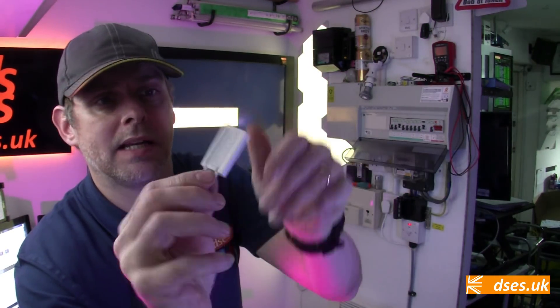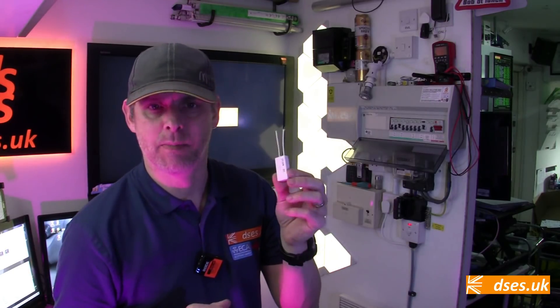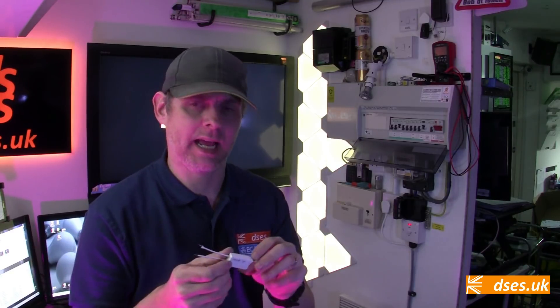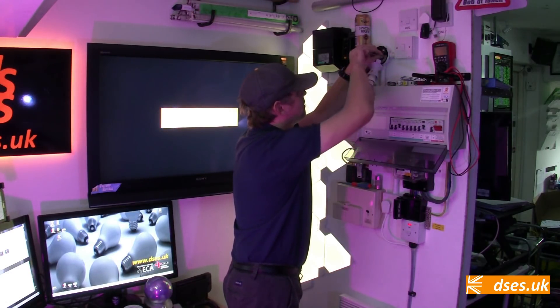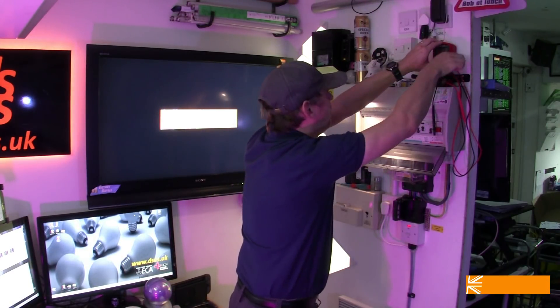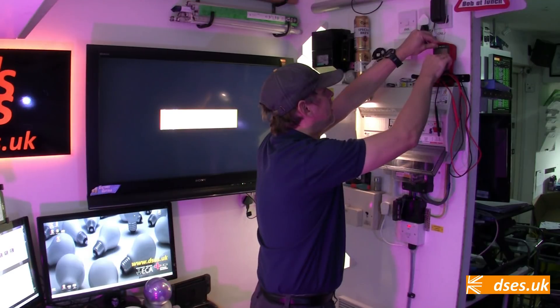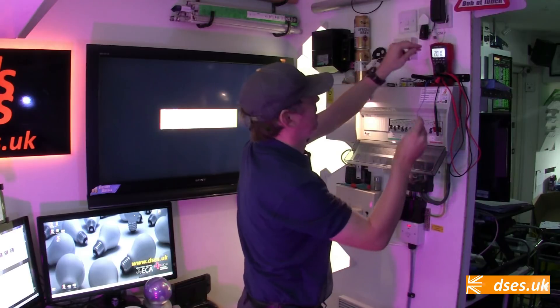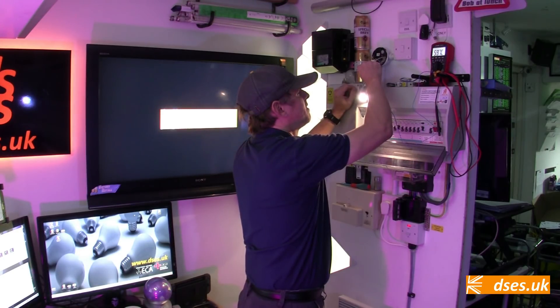I also have some of these — a ceramically cased snubber of some kind provided by a smart switch manufacturer after problems with their products a couple of years back. Simply labelled as 'LED adapter', I don't know what's inside. Resistively it shows about 15k and my capacitance tester can't get a figure out of it, so it might just be a resistor. I've seen similar things as RC networks too. If we try it on our light, it seems to do the job of squashing the nuisance glow. But I notice it's rather hot — let's get a temperature reading. With the probe on the ceramic case, it's at 56, 58 Celsius and climbing — into the 60s.